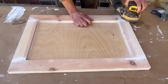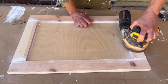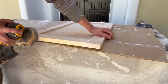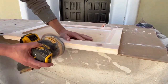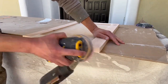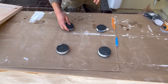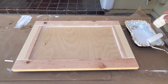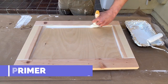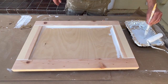The door is then ready to sand, and you should spend a good amount of time doing this and getting the wood ready for painting. The more you sand, the better the finished result will be. I recommend using first a primer and then two coats of very good quality paint. I often spray my cabinet doors, as you can see from my other videos, but you can use a roller and still get a very good result.